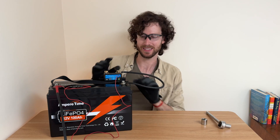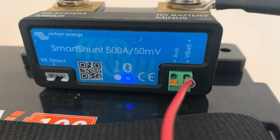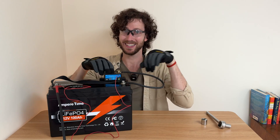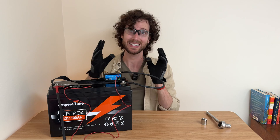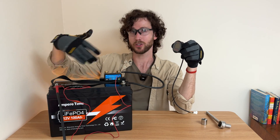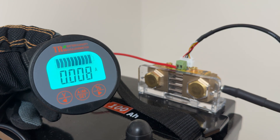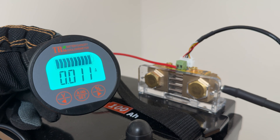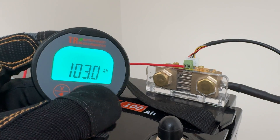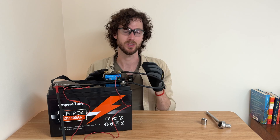The shunt is now powered on — you can't probably see it, but there's a little blue light flashing letting me know it's connected and powered on. The Smart Shunt is connected to our battery and now it's time to set it up. For monitors like the Ailey, the only extra step at this point is to plug the screen into the shunt — there's a little terminal on there, it just plugs right in, and then you'd use the screen to set up the monitor. But the Victron Smart Shunt doesn't have a screen; it has Bluetooth built in, so we're going to set it up using our phone.